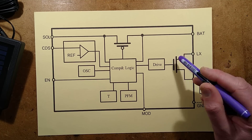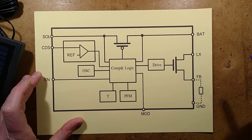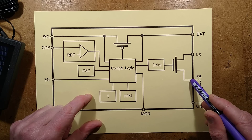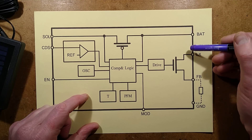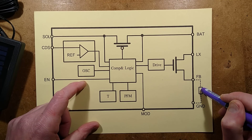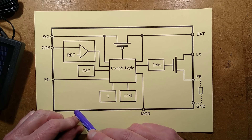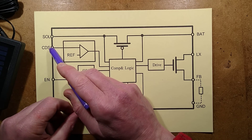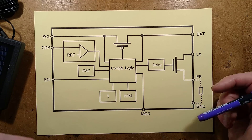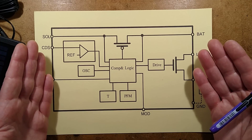It does have that little voltage threshold that once the LEDs cut off, they won't cut back on again until the solar panel has put some charge back in. There is the feedback sense resistor and it's got a sense voltage of 90 millivolts on that pin, which means that as the current flows through, that MOSFET will just vary its output to regulate it. In the case of this one, 0.33 ohms equates to 273 milliamps. It's got an enable input which was just tied low, and a CDS pin - I'm guessing that's cadmium sulphide. It looks as though that's for the option of either adding a light sensor or sensing the intensity level from the solar panel itself, but in this case it is tied to the negative connection, which means it's just on all the time because this is a shed light.